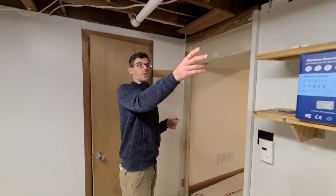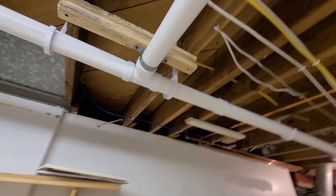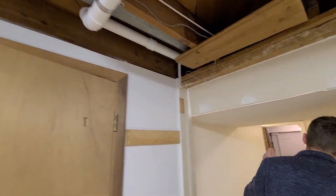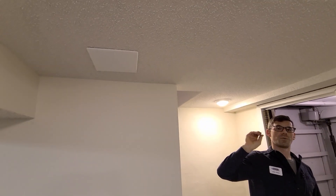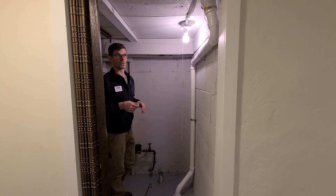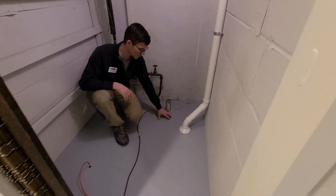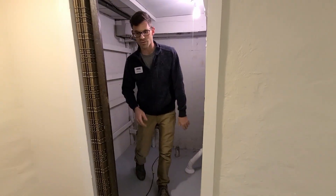Our pipe all runs back toward the closet, and the one right above Chris goes to the one with the manometer and alarm. The third one tees off and comes up over the ceiling and into the well room. We added a panel here because we've got to secure that pipe every six feet horizontally by code. This is the one that comes into the well room — we've got a valve on here to control the flow, but we need all the airflow we can get; we're only moving 17 CFM. There's some settling here where the old well pipe used to come up through.